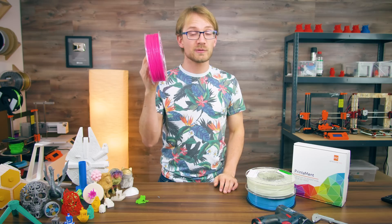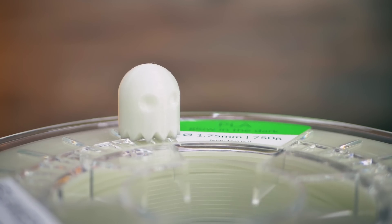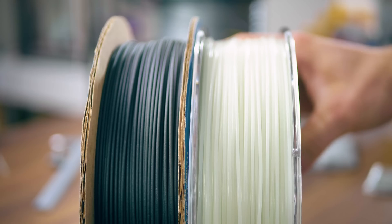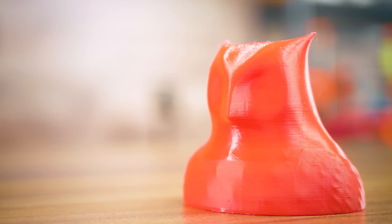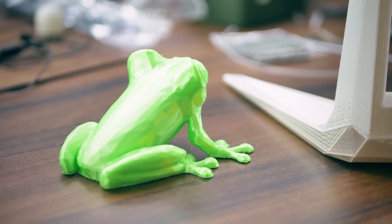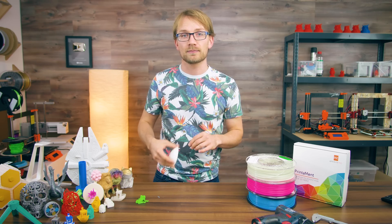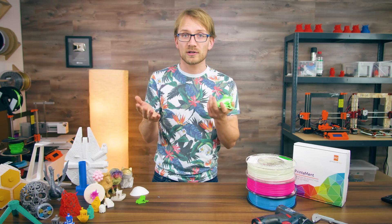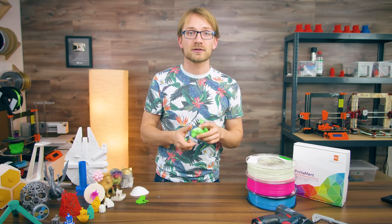You can never go wrong with a screaming pink, right? PLA has an enormous range of colors available, from translucent ones to fully neon-vibrant ones, to glow-in-the-dark and even some fiber-filled types. For glow-in-the-dark and fiber-filled filaments, you'll definitely want to use a wear-resistant nozzle. Most PLAs can even be printed to a glossy or matte finish just by changing the temperature or print speed. The newer PLA Plus types are a PLA blend with a modifier mixed in and behave drastically different from normal PLA — except for the shiny look, there are no real-world advantages, since PLA Plus typically prints worse than regular PLA and parts come out weaker overall.